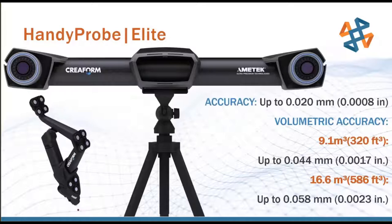And all the probe is saying, when you take a point with the probe, it just says, hey, record my position. So it's really not transmitting anything other than a yes, right? It's just saying, take a point. It's the C-Track that's really the brains behind the operation, because it's telling us that it's at this exact XYZ location. And then once it hears that ping of record that point, it sends that point to the controller. So that's how this is able to be a wireless system here.